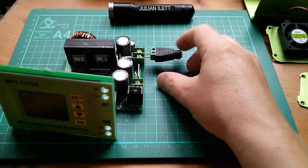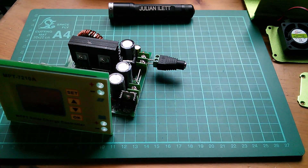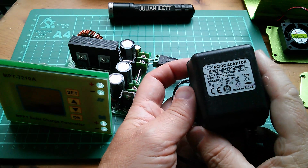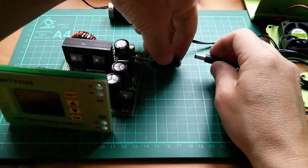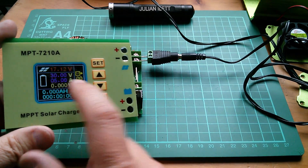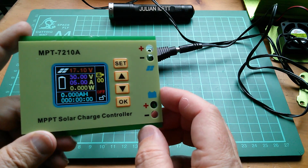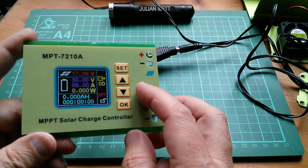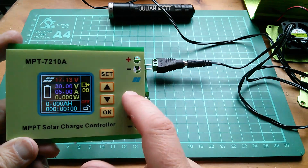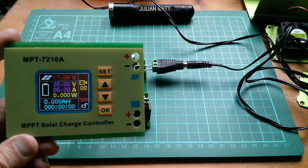I've put a connector on the solar panel side and I'm going to connect one of these old transformer-based 12 volt power supplies — that will probably put out more like 18 volts off load. I'll plug that in and try that. And that immediately powers up! It's showing me that the solar panel voltage is 17.12 volts, battery voltage it's saying is 30 volts even though there's no battery on there — so maybe that's something I have to set. It seems to be powered from the solar panel side. The odd thing is what happens at night — when the sun goes down, does this thing shut off and will it reboot reliably every time the solar panel voltage rises up? It's a very strange arrangement.